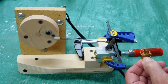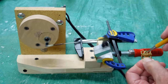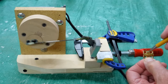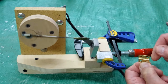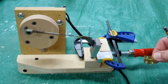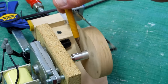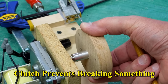I don't know why these hinges are tight. Possibly the plates are not exactly flat, or they could be over-crimped. The rod that goes through there might have a burr on it or may not have been absolutely straight when it was put in. This is my third set of hinges and these are the best ones I've come up with. I'm tired of ordering hinges and sending them back, so I'm going to go with these — we just need to loosen them up. Since this is not firmly attached, if it gets in a bind, that hub will slip, acting like a clutch.